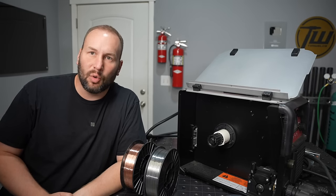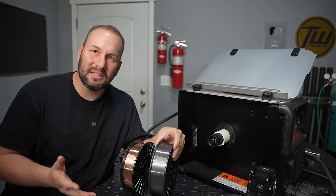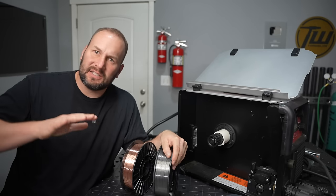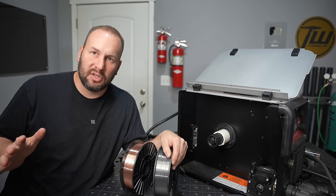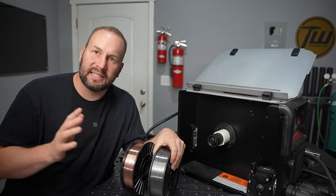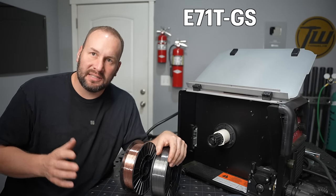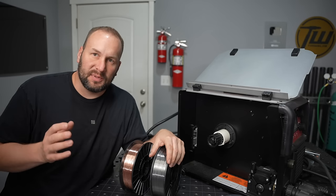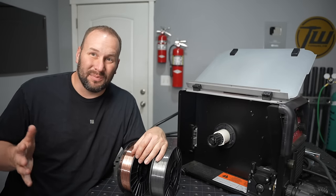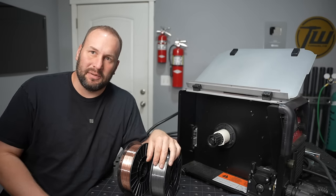Let's talk about the actual wire itself. There are a couple different types of flux core wire. There's self-shielded, like we're using here, where you don't need any shielding gas. There's also gas-shielded flux core wire, often called by trade names like dual shield or outer shield — that's a totally different setup. We're focused on self-shielded flux core, and the specific spec we're running is E71T-11. You'll see a lot of flux core wires listed as E71T-GS, which means it's not to a specific spec and the manufacturer has some liberty. I've used many brands of flux core wire and most work just fine, but I stick with E71T-11 most of the time.